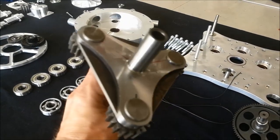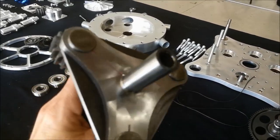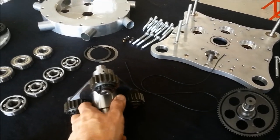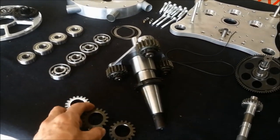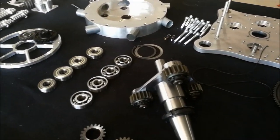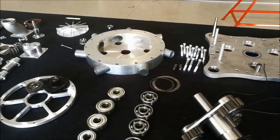There's a gallery drilled right through there — it's plugged — and the oil pressure feeds through the centre of that shaft from the engine to feed those three hefty planet gears. These planet gears are much heftier and stronger than the earlier ones, which were quite successful, but these are certainly stronger. So that's a reasonably new development we've just started to experiment with.